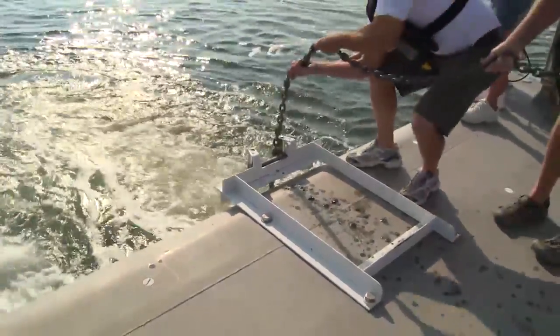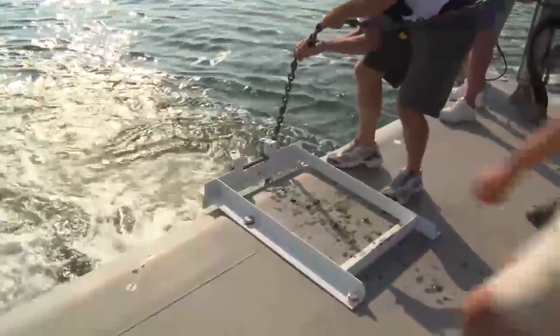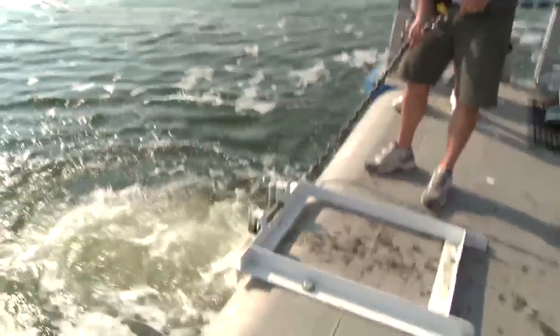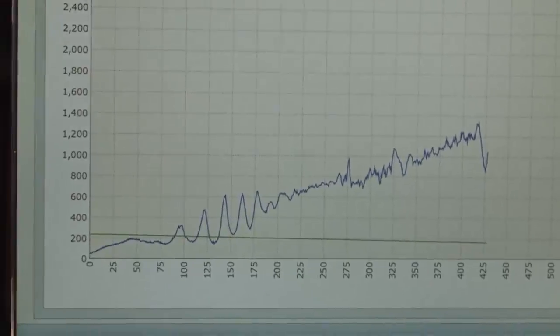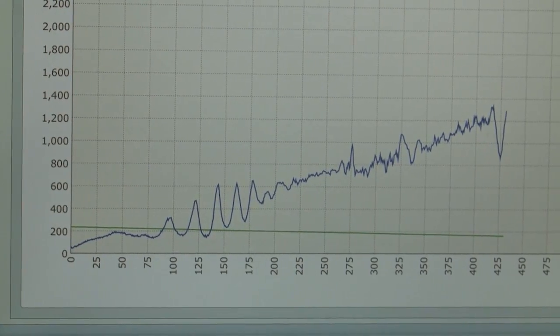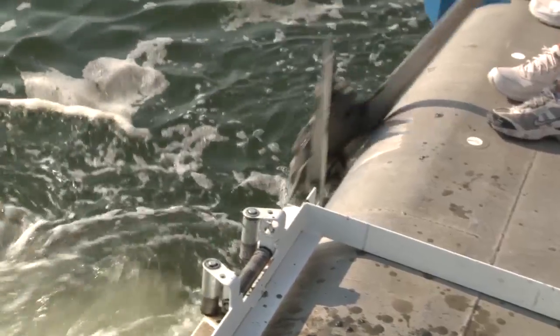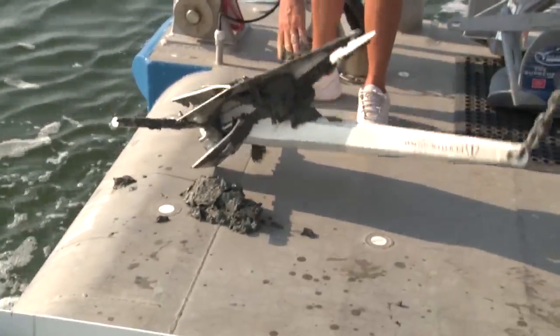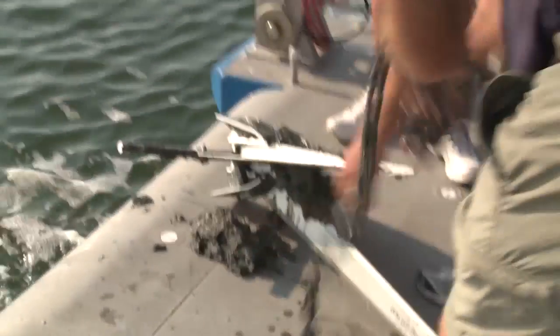We're currently pulling on the FX-37 set to 32 degrees. This is the second test of that anchor. The second pull had a nice smooth ramp up to about 1300 pounds, a little spike to 1500 pounds, and then a slow descent down. The anchor is set in its sand holding position, so we got pretty darn good tension out of what would be your normal anchor on board.